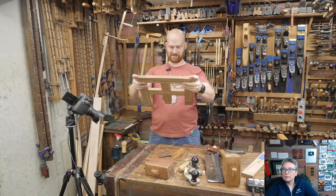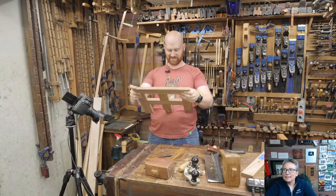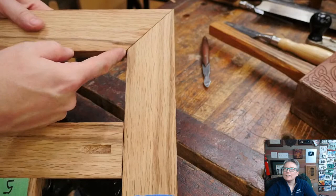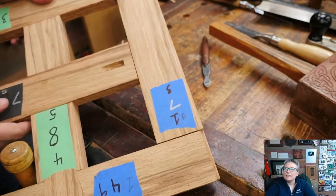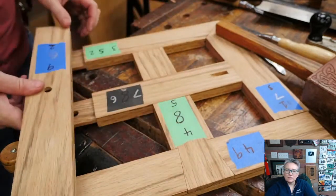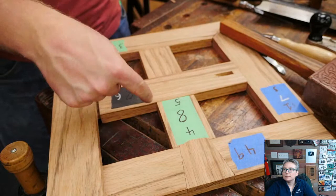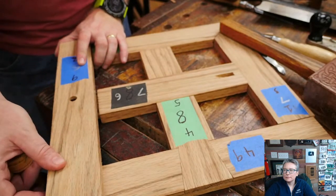I did something off. This window is not going to look very great. So here — the board is off over here, touching here, and way off over here. Apparently I moved that board over that way and I don't know what I did wrong. I know what I did: when I marked this cross, remember I put the clamp on it to hold it together and marked it — then this piece slid out and I put it on there and marked it. So there's my problem. The way I'm going to fix it is to make this slot a little bit longer, have it stick out this way a little more, so this piece can slide back down to where it should be. That means I'll have about an eighth-inch gap on the underside, but it's on the back so you won't see it.